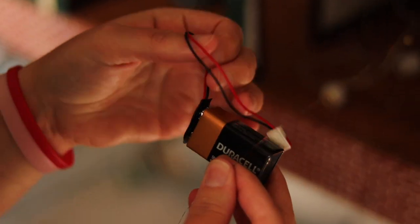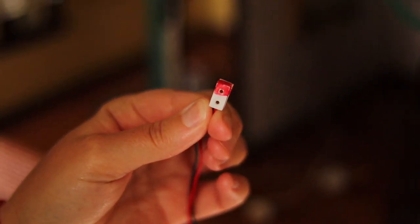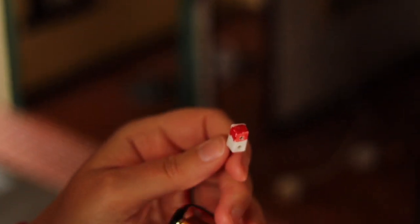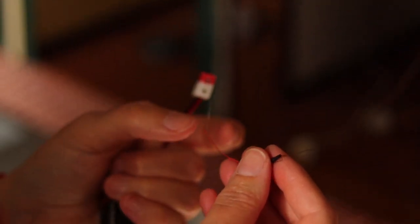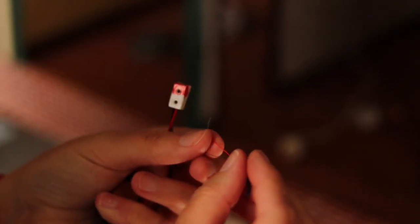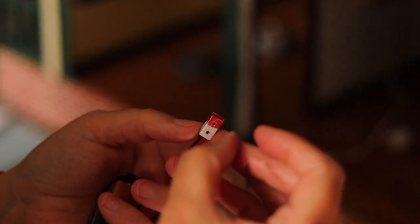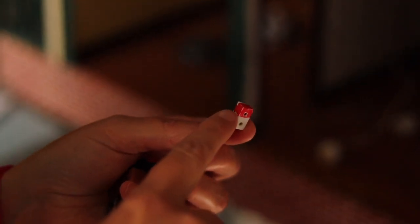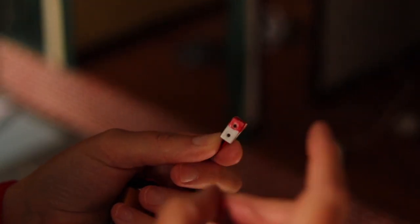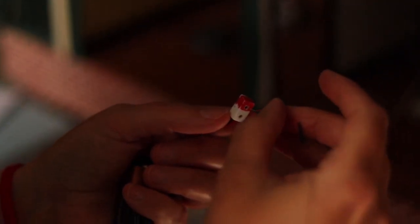Here I want you to see how bright this little light is. I'm using a 9-volt battery light plug — if you don't have one of these I would absolutely recommend getting one. I use them to test all my lights. The LED lights from Evan Designs are very easy to use. You just plug red into red and black into black. On these plugs sometimes it's hard to tell, so I colored the top of mine red — that was just through trial and error.